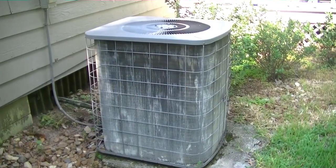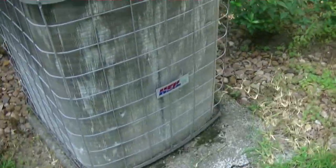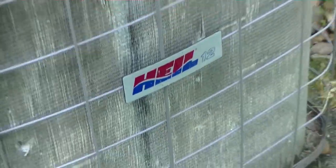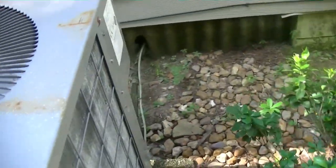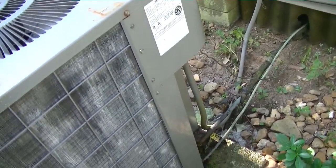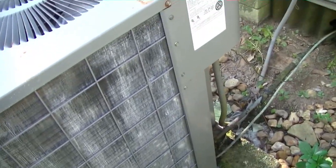We're going to move him to a 410a heat pump because the air handler is already made for 410a, so that's what we're going to do for him. Here is our unit that we'll be replacing today — a 12 SEER unit — and you can just see the condition of that coil, it's in pretty rough shape, it's flaking. Compressor is just running and not pumping, equal pressures. We've got to run new thermostat wire because we don't have enough for a heat pump.